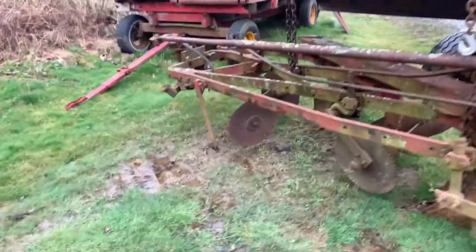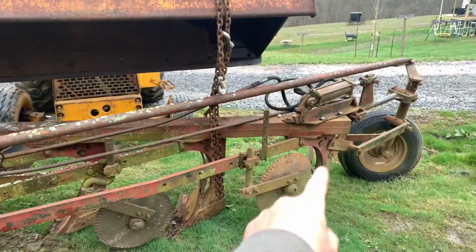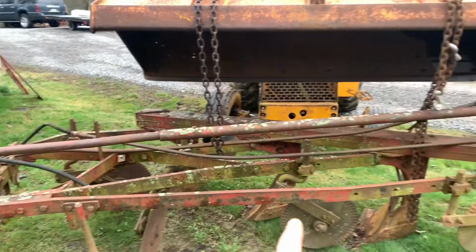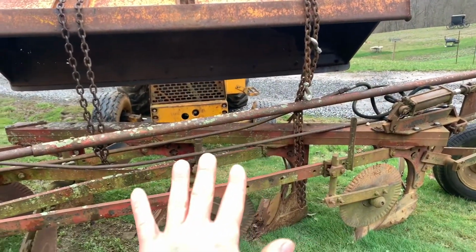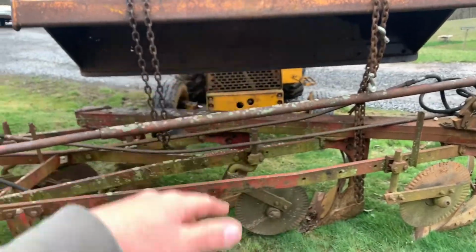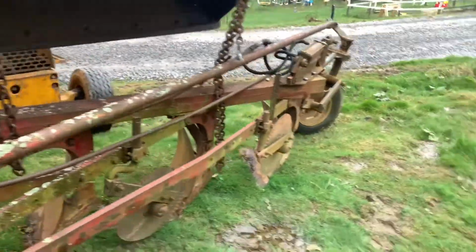All right, when you're loading a plow, you got your main beam that holds all your mold boards, and when they're semi-mount, you got your semi-mount. And no matter which way you load this, or chain it up, I should say, it always tends to twist, right? So what I'm gonna do is show you how to load one of these, and it ain't gonna twist